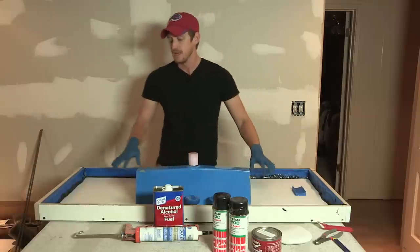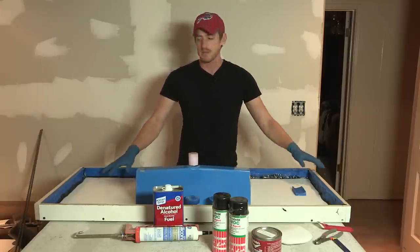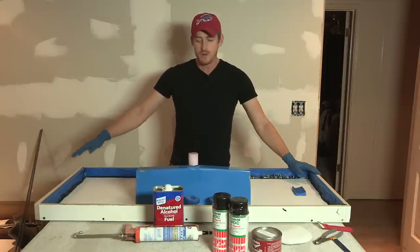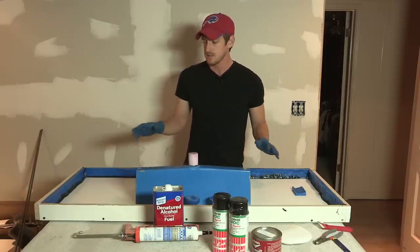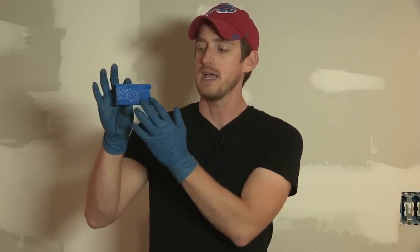I've done a bunch of work already and I just want to talk about what I've done so far. What I have here is a 48 inch vanity top — it's actually slightly bigger than that, it's 50 inches by 21 and a half inches, two inches deep. The reason why it's slightly bigger is I want a half inch overhang all the way around the tabletop. There is roughly a half inch thickness of this rough rock edge liner.